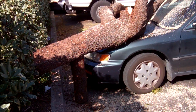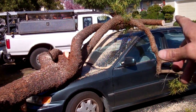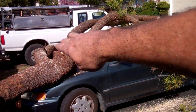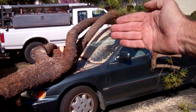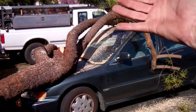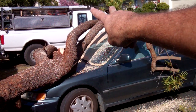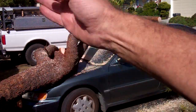So now I'm going to go ahead and just cut all these pieces off of the roof in such a way that I'll take one piece at a time. I'll start with this one over here and get it out of the way, get this whole thing off. Then I'm going to go on the back side. I'll make an undercut further up, keeping my weight pulling up on that piece so that it doesn't break through the skylight. Once I get these two off, then I'll get the last one, and then finally I'll come down here and I'll do an undercut and lift it up this way.